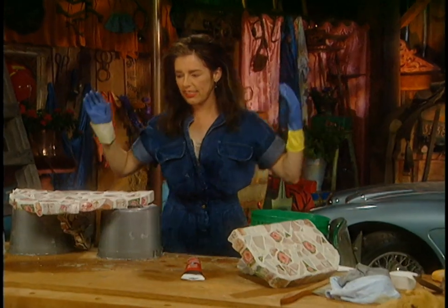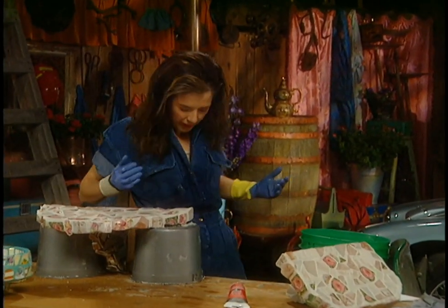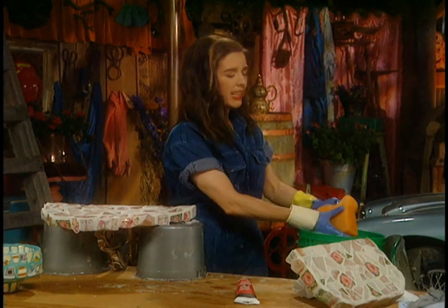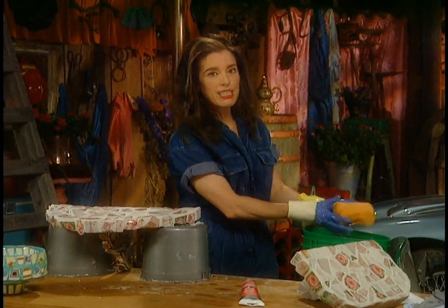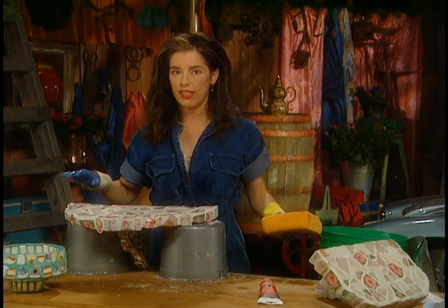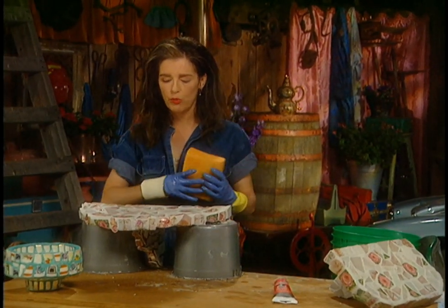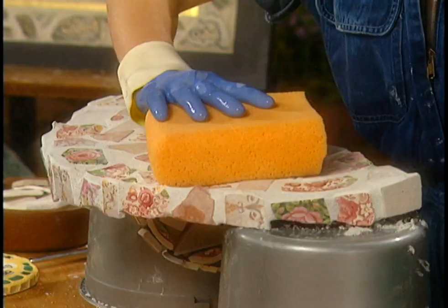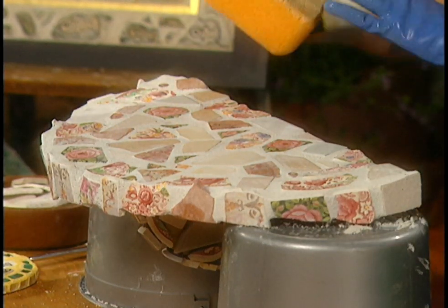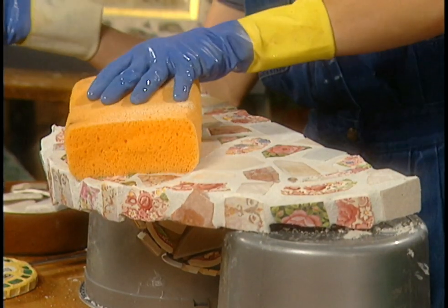If you're not slimed by now you're not having enough fun. For the very last bucket of water you need to be really fresh clean water — I've done five wipe-downs now, allowing about 10 minutes between each one. You don't want to tear the grout out, so you have to let it dry to a certain extent. Totally clean sponge surface each time or you'll leave a film.